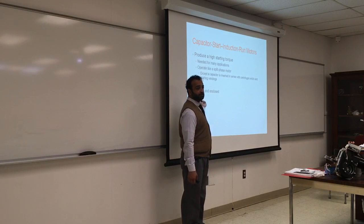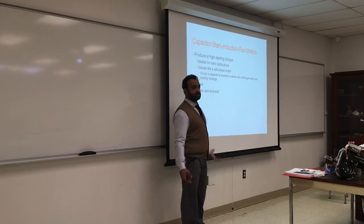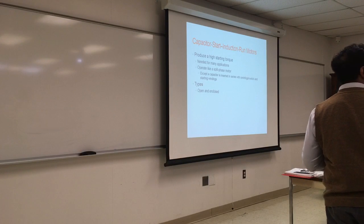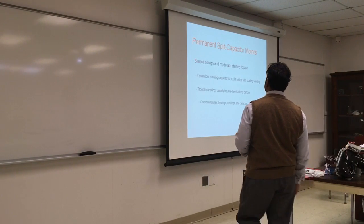What is open? Open means it's outside. Enclosed means it's hermetic, completely sealed. And the reason for sealed? Usually it's for ACs, because refrigerant is flammable. That's the main reason we have hermetic compressors. We want to isolate the refrigerant from the motor.